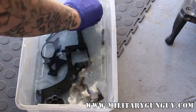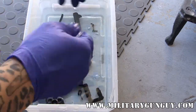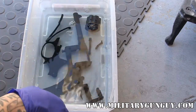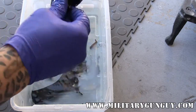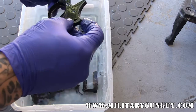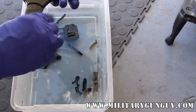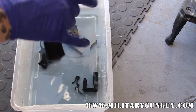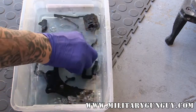The also nice thing about parkerizing is it will, to a certain extent, fill pits. As far as filling pitting itself, it's not going to eliminate the presence or appearance of pitting, but it will fill it very lightly because it is a rough surface — and obviously the rougher your base coat, the better it's going to coat. But it will fill pitting to a certain extent, and it is pretty durable overall. These parts actually look really, really nice.